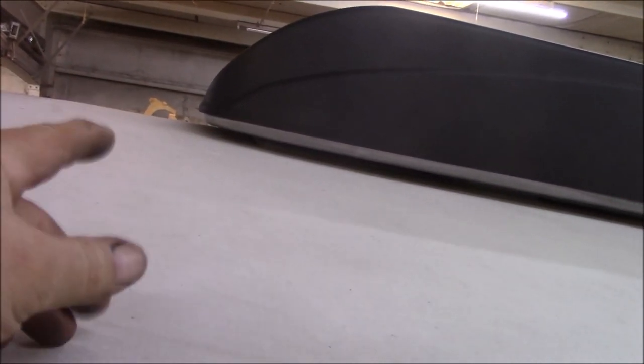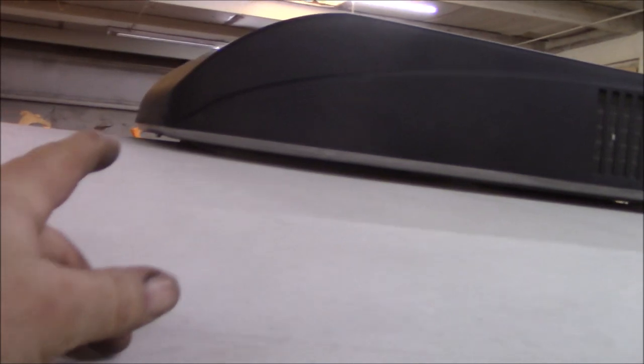And you can see underneath there is a foam gasket. All the debris, all the pollen, all that fallout is just going to end up on that gasket and dry it out. When it dries out, then it'll start leaking. It's chronic. It's going to be real small, it's not going to be flooding in. It'll just be real small, and then it'll start rotting around there. That's why everything needs to be up on a curb. So when we put this up, it'll eliminate that whole problem for sure. But that's the RV industry's way of sealing your AC, just with that foam gasket.